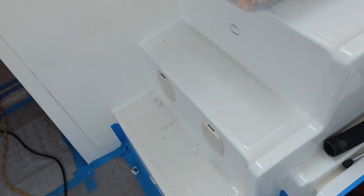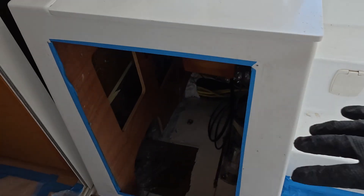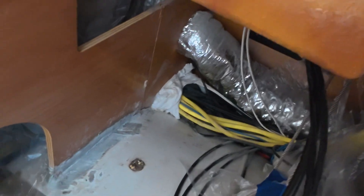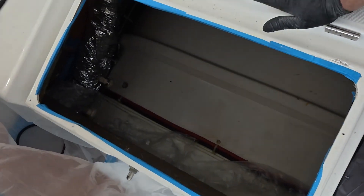This is a Lagoon 450 Sport. The sport has this compartment here that I've shown you before. This one fell off overnight — I'm going to fix that before we start grinding, because we don't want the dust to go all over the boat. It's all sealed up everywhere because we're going to be grinding all this and the top part, then epoxying it all in. For the propane locker — I've got to go into that hole, I don't really fit, but I'll figure it out. Fix that joint — you can see it's opened up, it's cracked on the bottom, the two panels are separated. So if we epoxy this and there's still movement, the joint on the wall is going to open up. We're going to do that joint also.